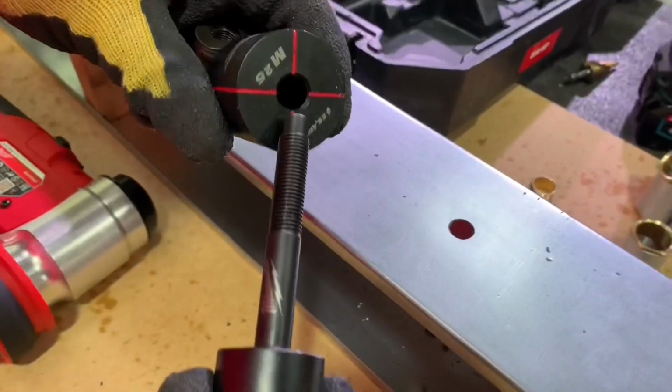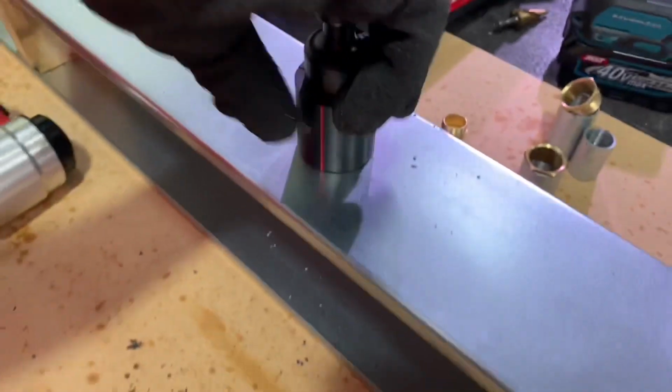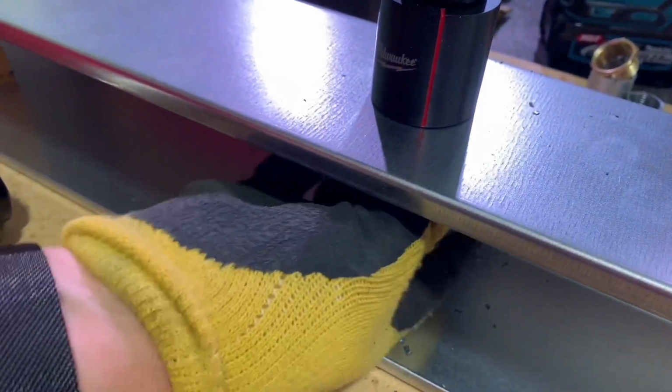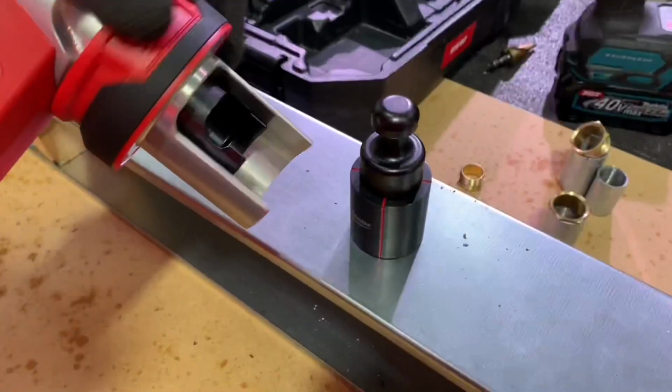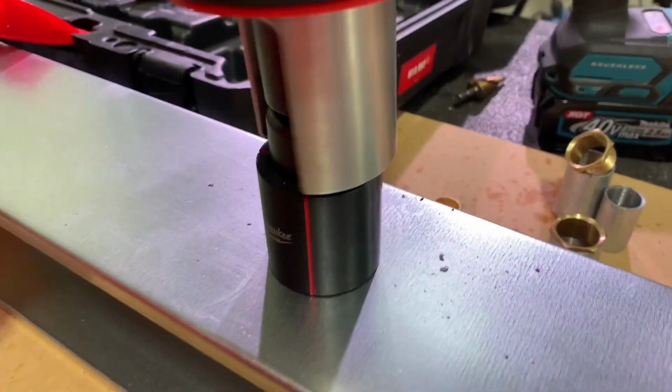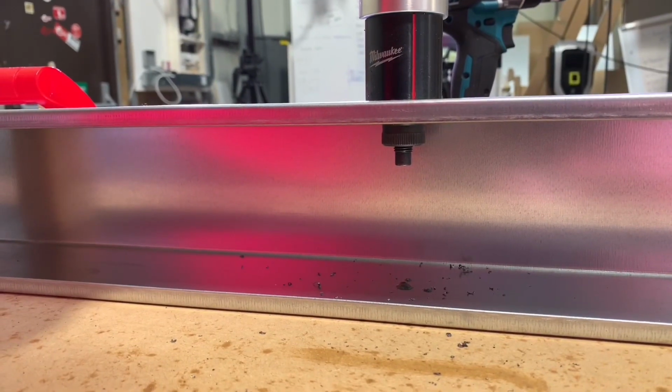We've drilled our pilot hole, so now let's just assemble the die mechanism onto the activator. Put that in there and then put our cutting die underneath. So we've drilled a hole, but we're going to benefit from having that super clean hole when we cut it, aren't we? Well, if this review turns out well, it'll be clean. If it's not, then it'll be a raggy hole.